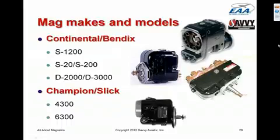At any rate, if you have a Lycoming engine whose model number ends with a D, that means you have a dual mag on it, and these mags are going to become increasingly problematic because a lot of the parts simply can't be had anymore.